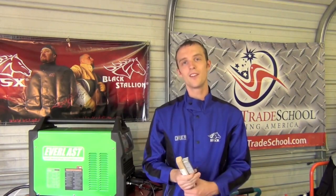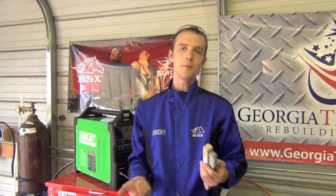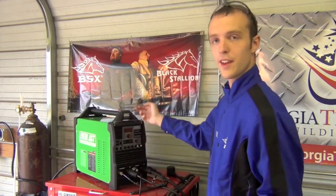Not only do we have the wire brush on our side, we also have alternating current. As the name implies, alternating current switches between electrode positive and electrode negative - with this machine, depending on the setting, between 20 and 250 times per second. When the piece of aluminum you're welding is negatively charged, it's bombarded by positive ions which work to break up tiny little bits of loose broken-up oxides. That's the cathodic bombardment process, and that's why AC is commonly used to TIG weld aluminum.